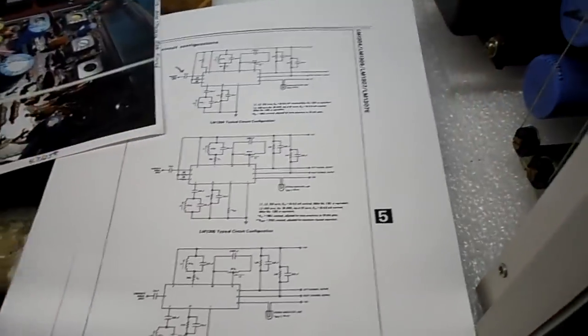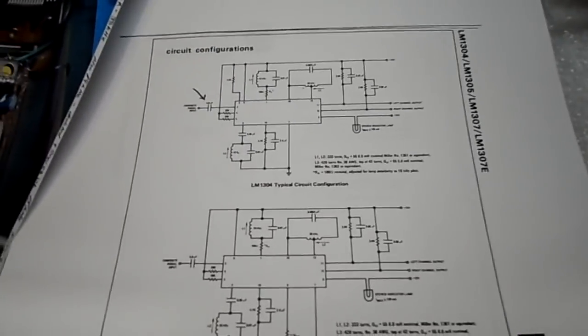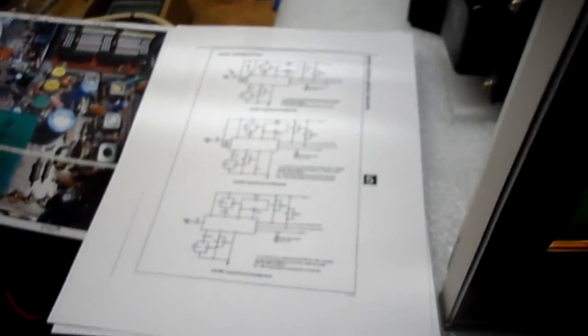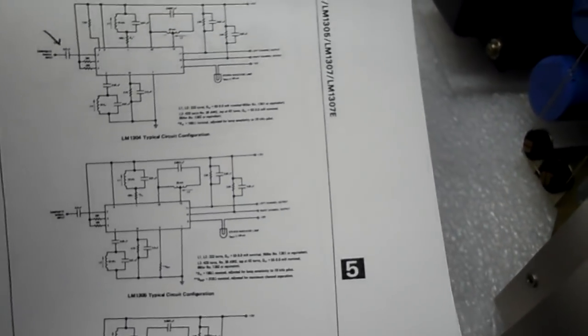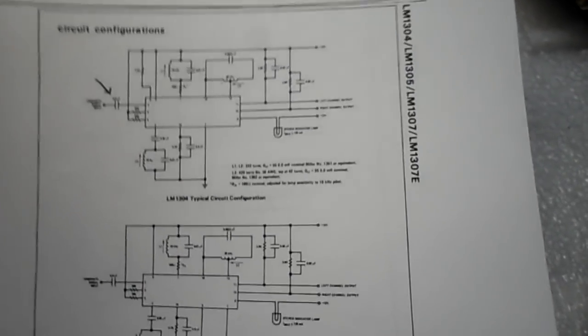I have a blurry PDF of the Morse. Whenever you run into problems with a restore, I always like to go back one step at a time and check as I'm doing things. In this case, eight capacitors — what's the big deal? I have a datasheet on this FM stereo demodulator. Because AM is working and the amplifier is working — we haven't touched any of that — just the FM stereo is affected, and it's real sensitive.